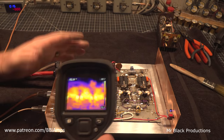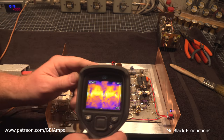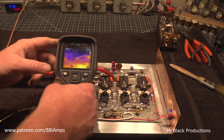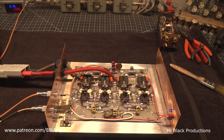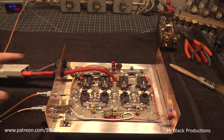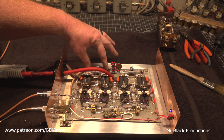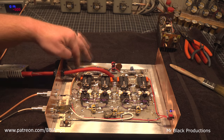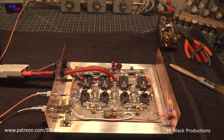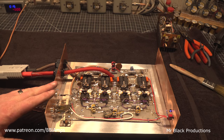Downside to all messenger — I mean Pac-Man boxes — the output transformers are a little bit warm, flybacks are a little bit warm, tuning caps are a little hot, but the transistors are ice-cold, heatsink is 74 degrees, and none of the balancing circuit is hot. Normally on this style of amp you'd find a little step inductance in a corner — like all the messenger boxes built by Mr. B — you'd need a cap, inductor coil, another cap, and then another piece of coax. How they've compensated for that is with passive capacitance, which I think is awesome. Really cool old-school, old-tech in this thing — I love it and it works really well.